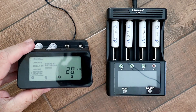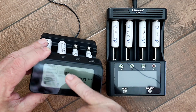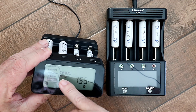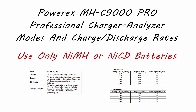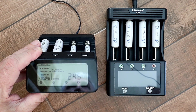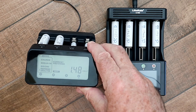There's a video on my channel about how to use the PowerX. Basically, you put your batteries in, then cycle through and select the mode you want: charge, break-in, discharge, or refresh and analyze. Then it gives you options to select the charge and discharge currents, and the instruction manual tells you which ones to select depending on the capacity of your battery. There's also a nice feature where you can set it once and apply those settings to all four slots — but it is manual, there's no automatic setting.